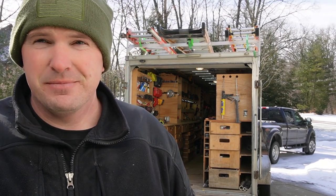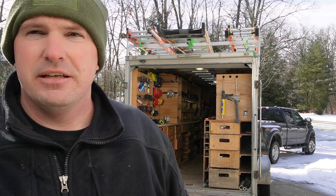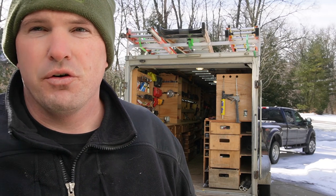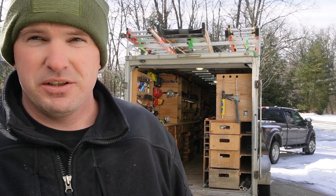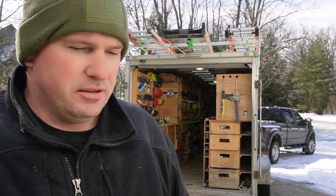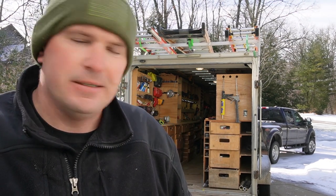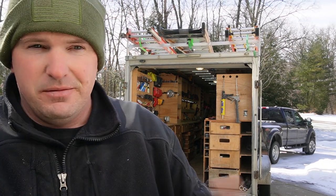It's been four years and it's been fantastic — an absolute asset that has paid for itself and will continue to pay for itself. The next tool trailer won't take nearly as long to build out because I have this one to work out of, and I can build it in sections and then transfer everything into the new trailer. If I was going to do it over again: always get as big a trailer as you can, definitely tandem axles for the brakes and stability when unhooked, and interior height is immensely valuable — nothing less than six-foot-six. I'm going with seven-foot to seven-foot-six in the next trailer because it just fits my needs better. Appreciate you guys liking and subscribing.